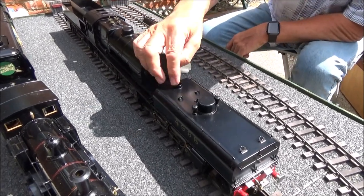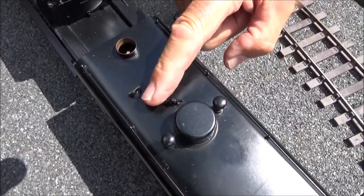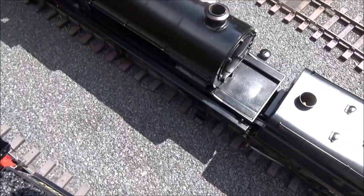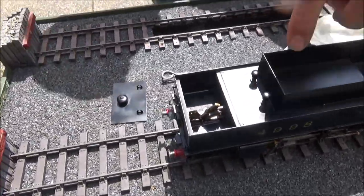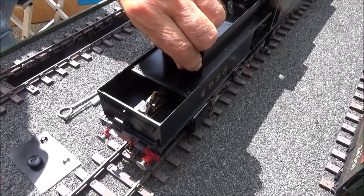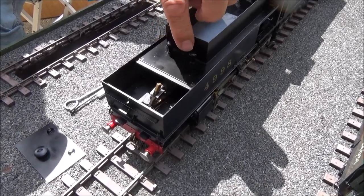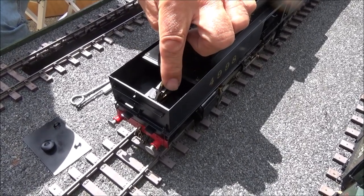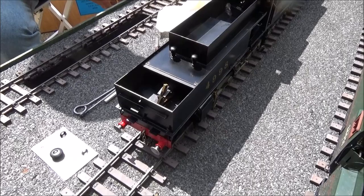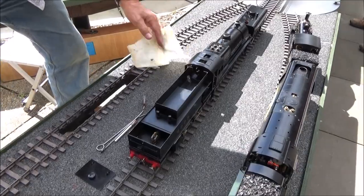Now there's a bypass control, there's a return pipe; you can see there's a bypass control there for the front pump. And there's also one on the rear, but you won't spot it straight away unless I tell you, because it's this vent. So that turns, and that's a return pipe as well. I've got one of these myself, and on mine I put a return pipe from the top of the hand pump coming backwards here, so you can actually see the return there, which is a good thing to do. And operationally, it's pretty simple.